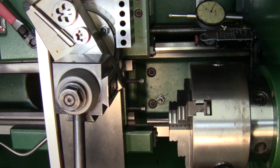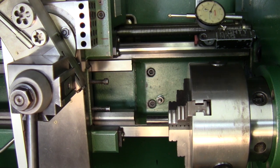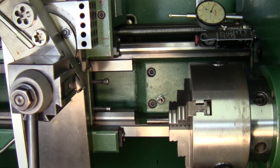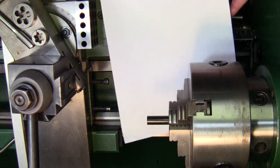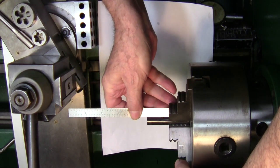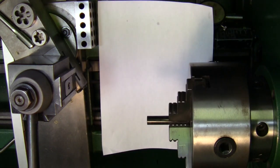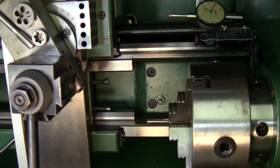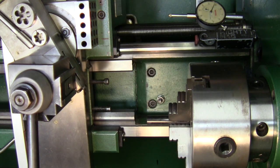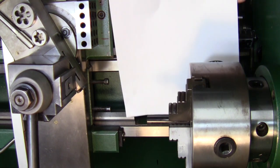I'm going to go through my setup and the tooling I'm going to use to make this. I pull my material out to about an inch and a quarter, keeping it as close to the chuck as I can. Normally the first operation would be to face it off, but since this piece has already been faced off I don't need to do that. So I'm going right into putting a 45-degree chamfer on the edge.